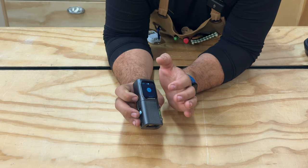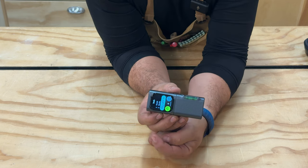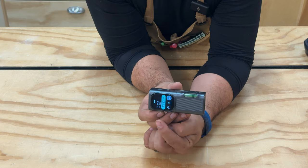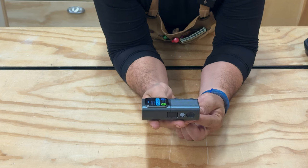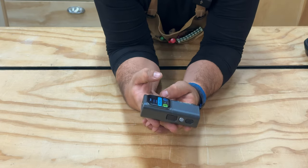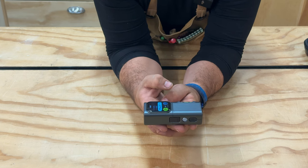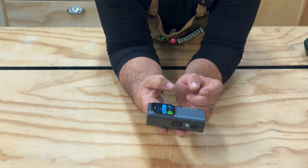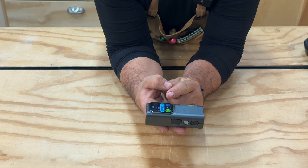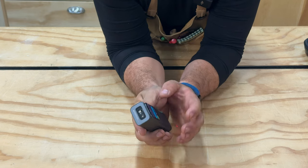This feature has lots of different options where you can single out the top laser or the bottom laser. A really cool feature is the auto leveling adjustment — the green icon disappears when I tilt this really hard and comes back when I return level. What that's doing: when taking a measurement with the bi-directional laser, I need to hold this perfectly flat — if I'm not flat, I'm measuring a diagonal line, which is a different measurement. If I'm off just a little bit, the auto calibration knows how much I'm off and still gives an accurate reading, doing the math to figure out what the number accurately should be.